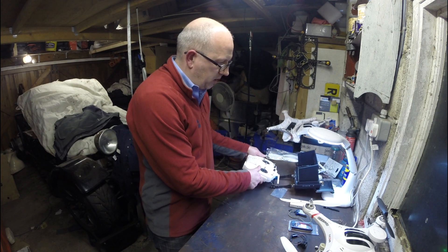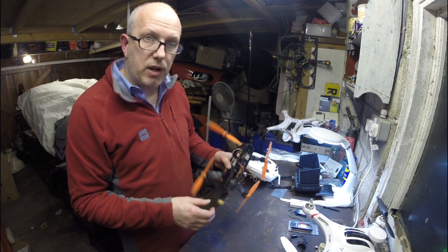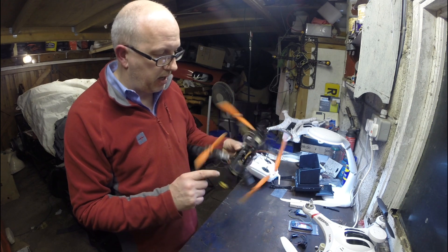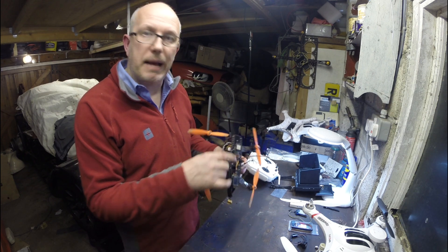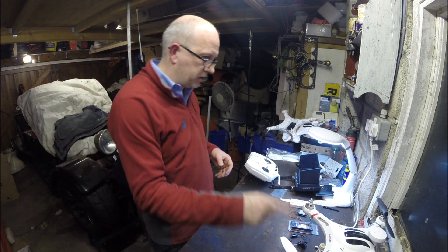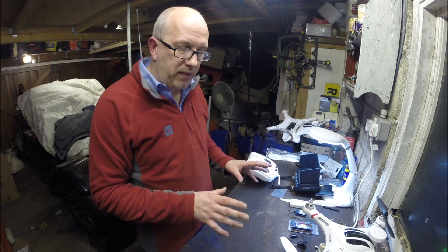When you're dealing with something like a mini-quad — and the mini-quads work exactly the same way — you really don't want that kind of latency. So in this one we've got a much faster camera and a slightly bigger transmitter. Underneath here we have a Team BlackSheep encapsulated one, and that's running 500mW as opposed to that one, which is 200mW. So that's the basics of how the FPV works.